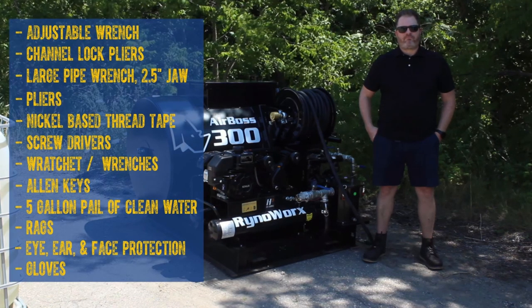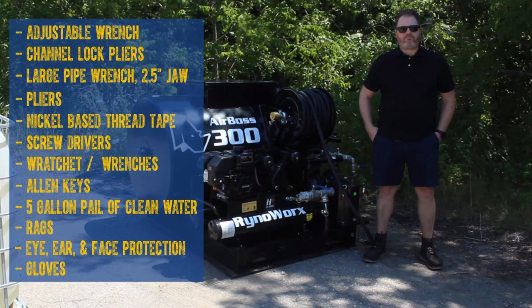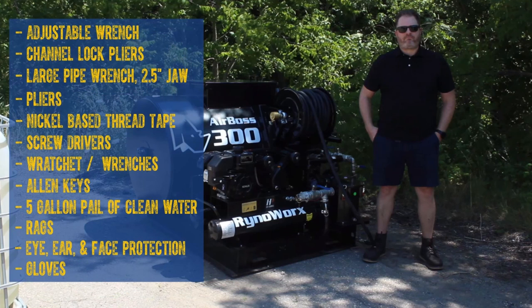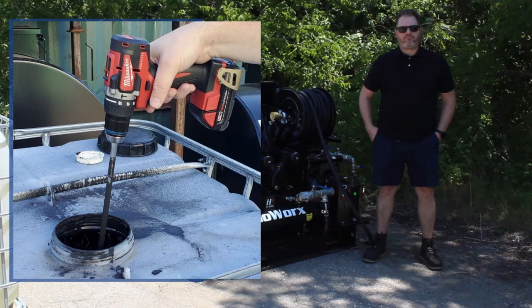Voiceover here — just a pause to touch on a few things from today's video. RhinoWorks recommends having a minimum of five gallons of clean water on hand for cleanup and hose priming. This does not include water required for your mixing ratios — you may need a 55-gallon drum or more depending on the product. Please consult the manufacturer for appropriate ratios, as some products require no water while others may require 30% or more. We also wanted to stress the importance of mixing your sealant if it's been sitting for more than a couple of days, and recommend adding a tote mixer and a drill to your list of things to keep on hand.